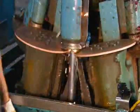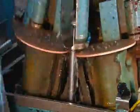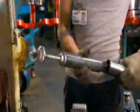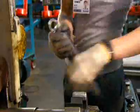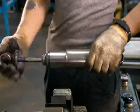Two copper welding wheels fuse the head assembly to the base assembly with a cap. This closes the unit, sealing the oil inside. Next, they weld on a dirt shield, a steel casing that prevents dirt from hindering the movement of the piston rod.